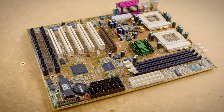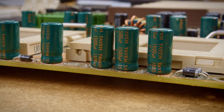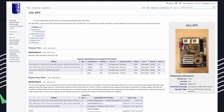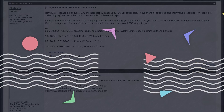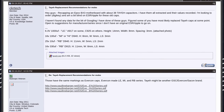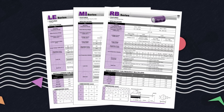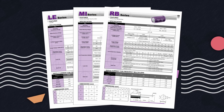There are still the BP-6.com and BADCAPS forums up with information from people who had their boards going bad during this time. Capacitor replacement information was circulated so those who were willing to try and fix it themselves could do so. This leads me to the board I have, which is now 23 years old. Mine still somehow had the original capacitors on it, which I'm guessing means it hasn't been used in a long time. I wanted to get it working again and share how I did it on CapsWiki so others may do the same. When I write pages on CapsWiki, I try to find out as much as I can about the original parts so the most compatible parts can be found for the replacements. Due to the popularity of this board, I am nowhere near the first to sleuth around for information on the Taya caps, which is probably a good thing because the datasheets have been archived and may have been lost like many others I've tried to look for.